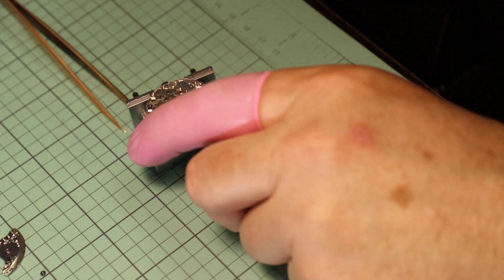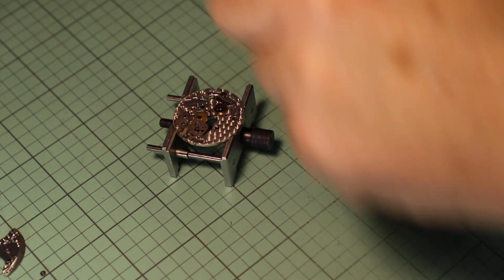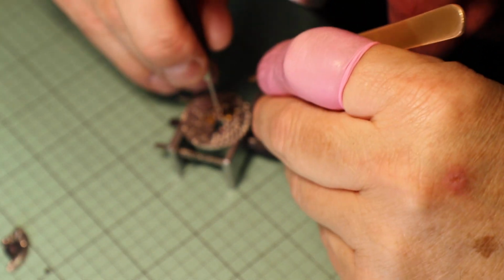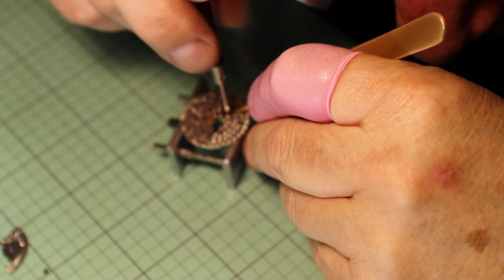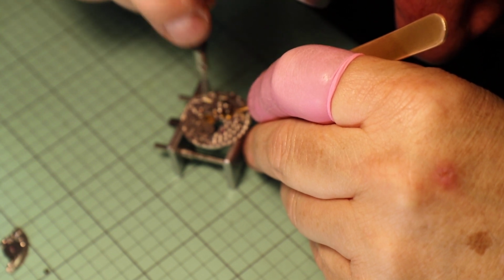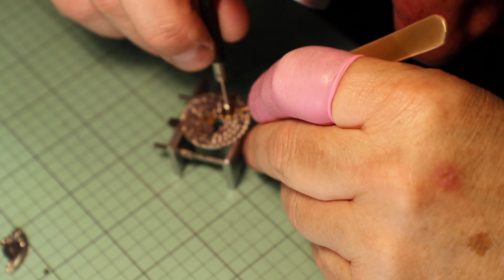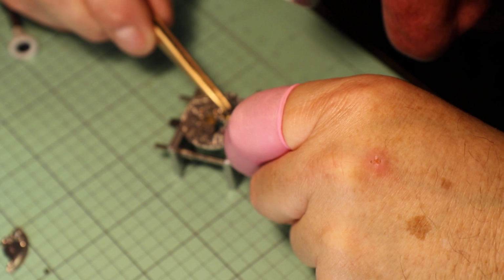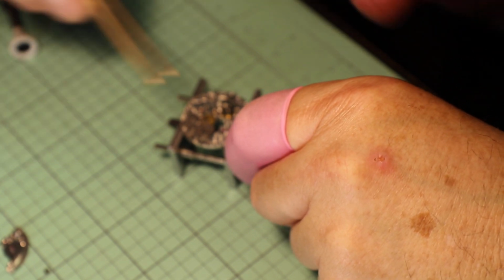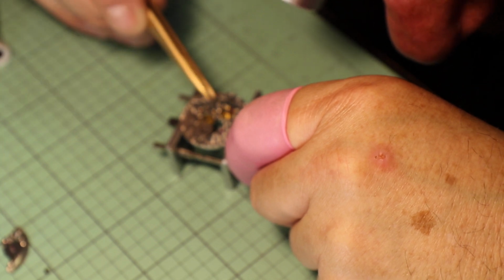Is this the bits that go around the stem? No, this is our rolling jewel for the day advance. Oh, okay. And I'll show you. Okay, so we are going to be careful. This is our date advance wheel, and it works with the pinion that I took off earlier that works with the hour wheel. It's a different pile of parts. Take him up. Now, see that jewel right there? We don't want to lose him.